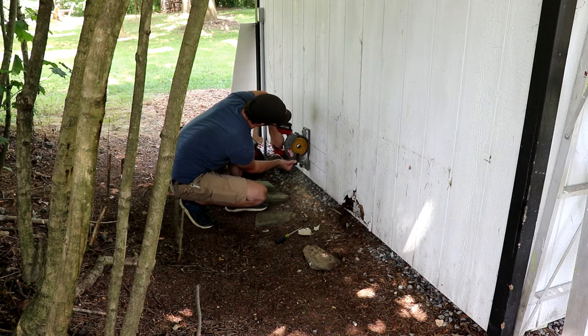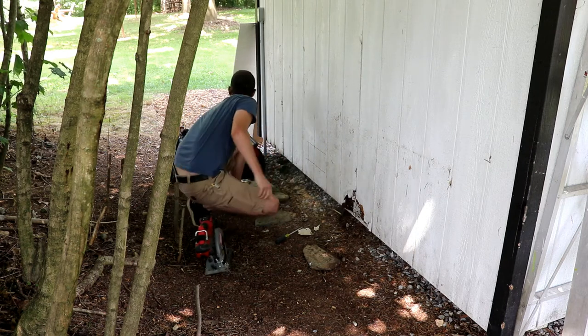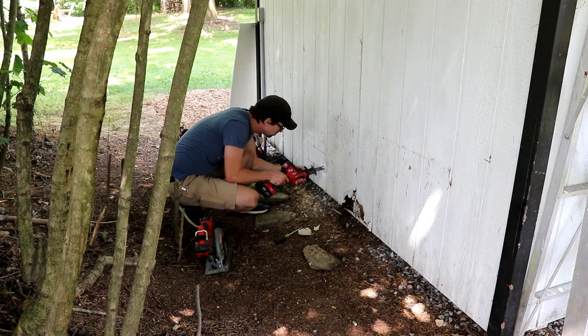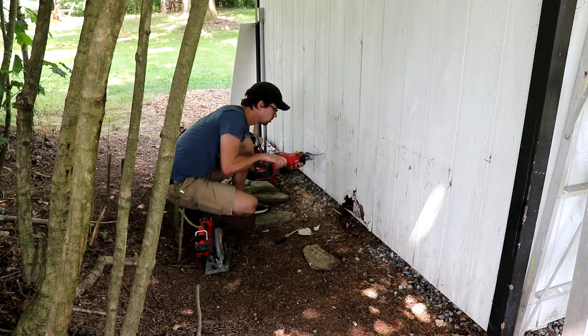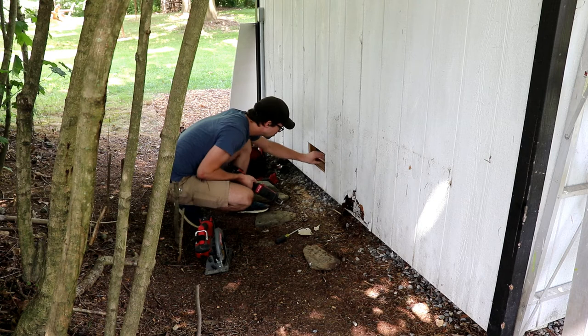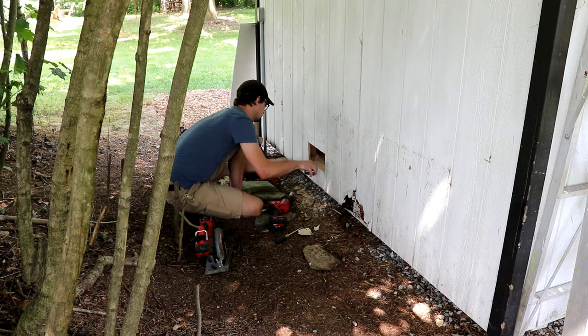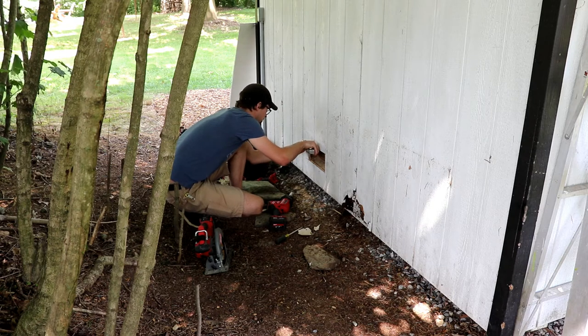To replace this patch, I'm going to start by cutting an access hole within the area that I know I'm going to replace. I'm doing this to get a solid location on where the studs are. I can get a general location by looking at where the nails are placed from the outside, but I want my patch to land right in the middle of a stud, so I'll cut this hole to measure to the middle of the studs and cut an exact 48-inch patch.